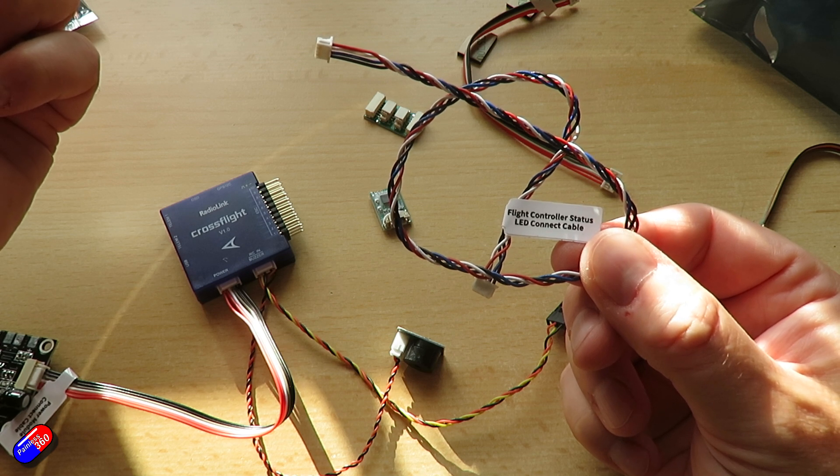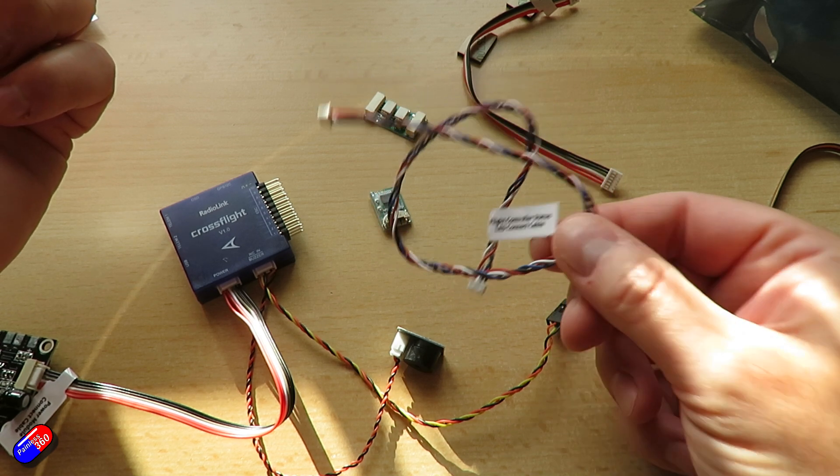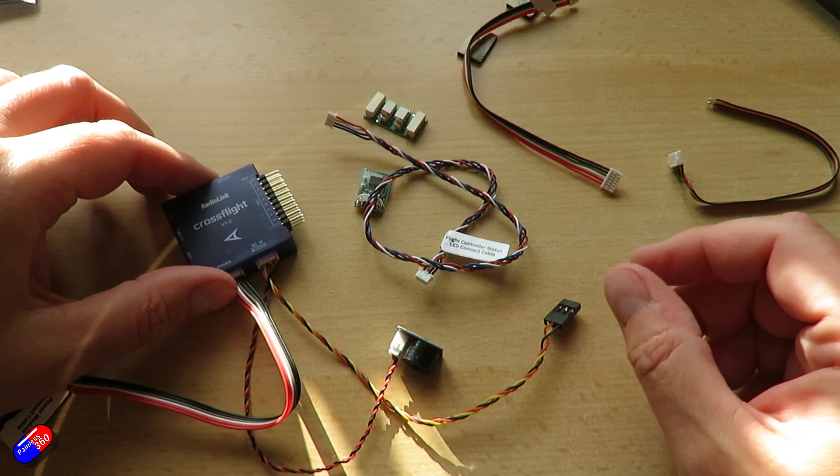So this is a very cheap way to get a flight controller, GPS and compass unit that you can plug into a specific version of Mission Planner and play with. Would I use this on a high-end system? No, probably not. There are bigger, more expensive Pixhawks with vibration isolation, IMU heating elements, and redundant sensors — none of that is available here; there is vibration isolation in software. But if you wanted to put a cheap flight controller on an ArduRover, a car, an ArduBoat, or an ArduSub, or just mess around with Mission Planner and try some stuff you've seen on YouTube, then this is quite a cute way to do it. I'll put links down below. Normally Radiolink isn't one of those manufacturers that I think of when I consider Pixhawk, but maybe it should be.